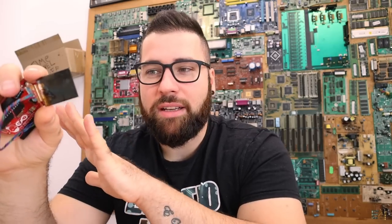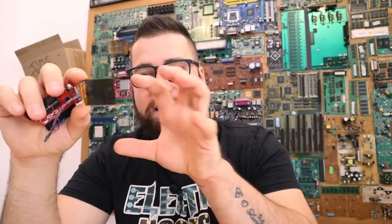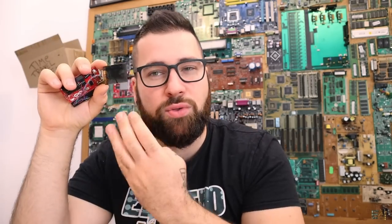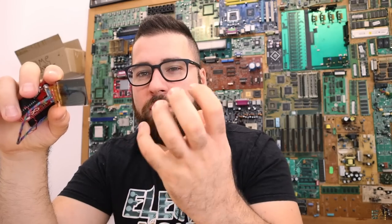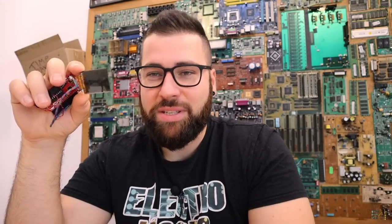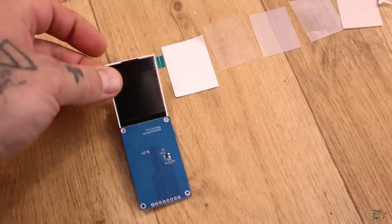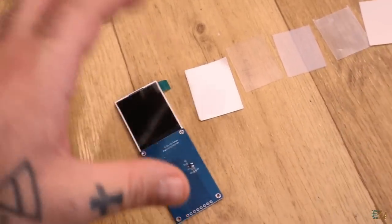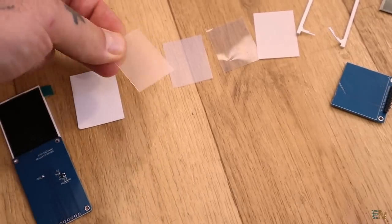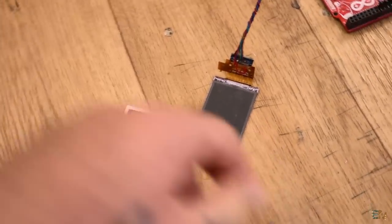I'm also thinking of using this as a kind of wearable display like Vegeta from Dragon Ball, using Fresnel lenses to focus close to the eye. This here is the LCD module — as you can see, it's not transparent at all in its original state. To make it transparent, you remove several layers from the backlight: the protection layer, the plastic diffuser, additional diffusing layers, and another protective layer. You also remove the plastic frame cover to make it as flat as possible for the resin printer.